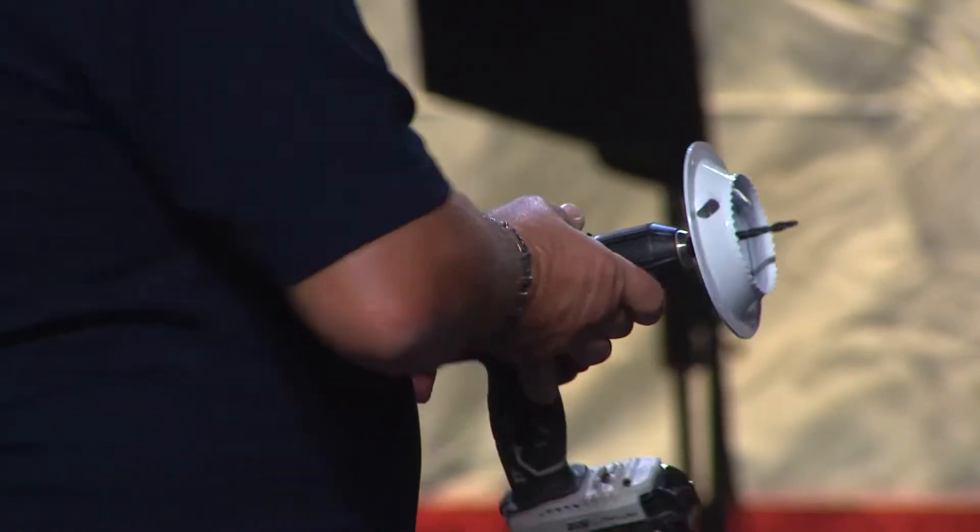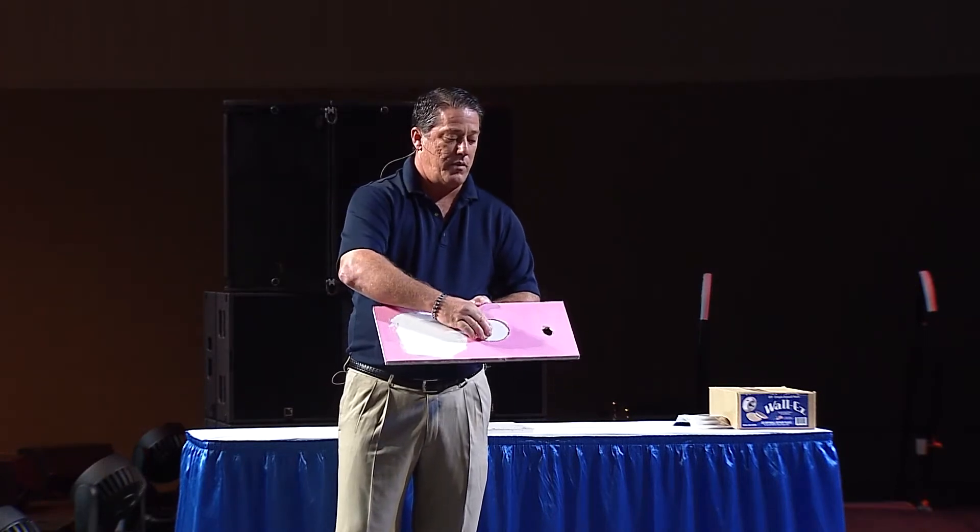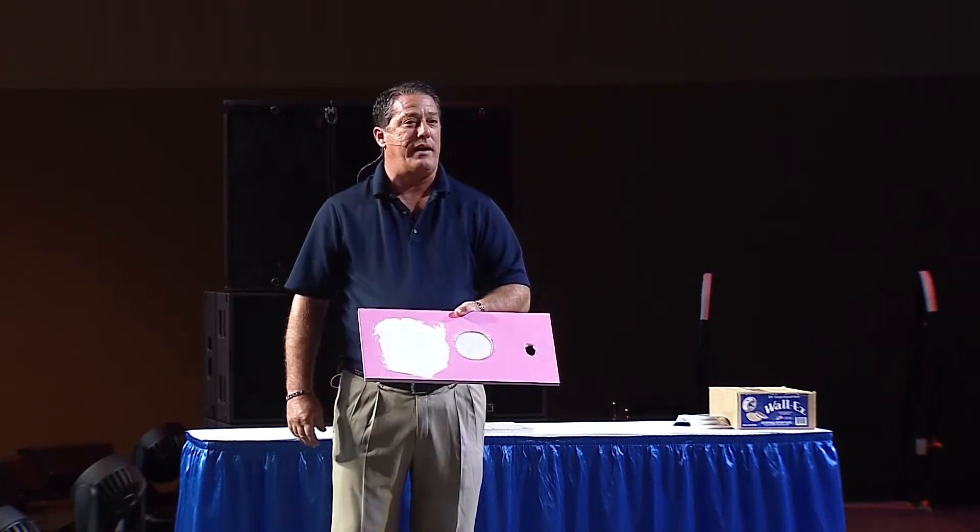It's easy to assemble — put the saw into the drill, cut out an area that's got damage. The typical damage that most people are aware of is something like a doorknob hole. You would use the saw to cut out a tapered hole, and we provide a tapered plug that fits right back into it.